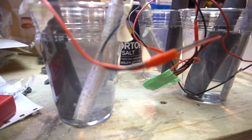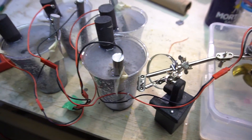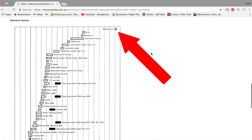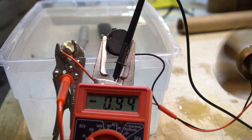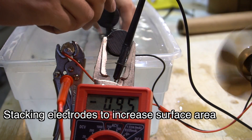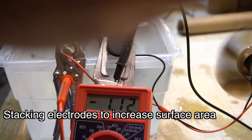Let me quickly explain what's going on here. Basically we have a battery that works through ionic chemistry. We have two electrodes made up of two different metals - one magnesium and one graphite. When you put them in an electrolytic solution you get a current and voltage. I found a chart online showing that magnesium and graphite had the greatest voltage potential. During initial experimentation I found out this battery really sucks - the internal resistance is super high, meaning when I try to draw amperage out of it, the voltage rapidly drops off. That's why I put all the cells in the battery to kind of get more out of it.